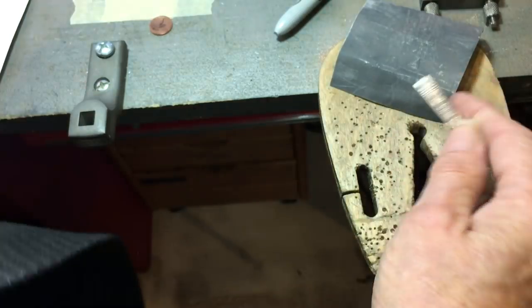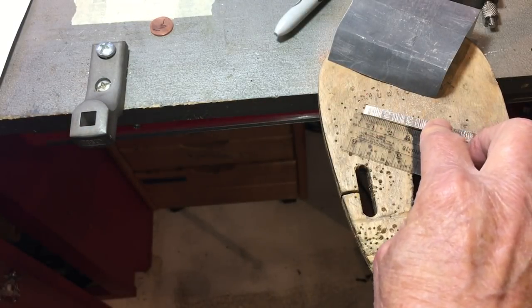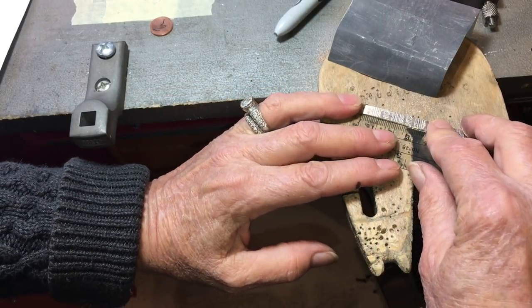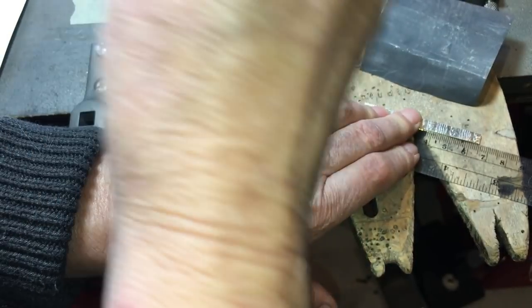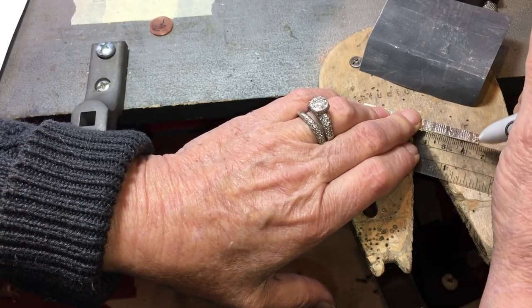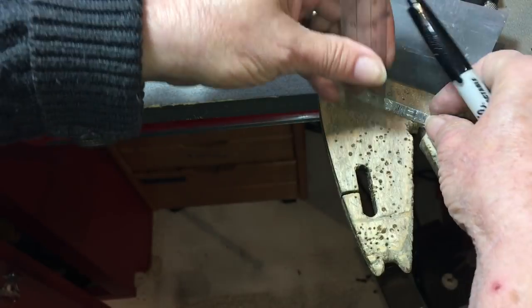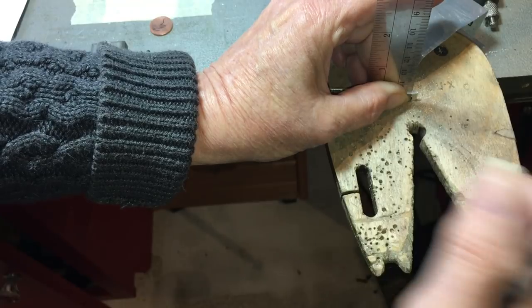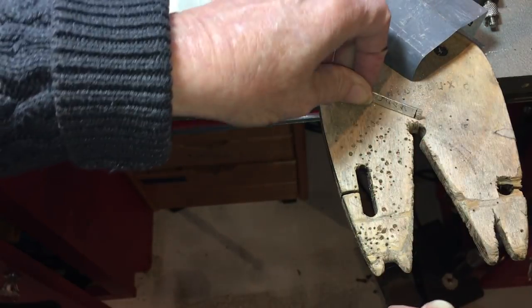From here I can measure off of my ring shank — 61.55 plus a quarter. I put my line on the end of the shank material at almost 62mm. I do a fancy method of marking: I push the ruler flat down on a flat surface, make a square, and draw my line. I'm going to go cut this on my shear — you could also file it or saw it.